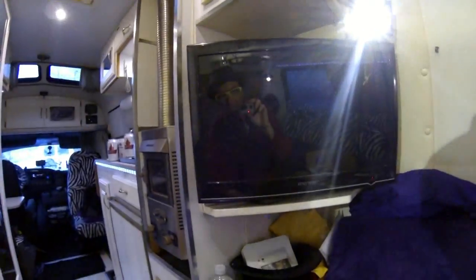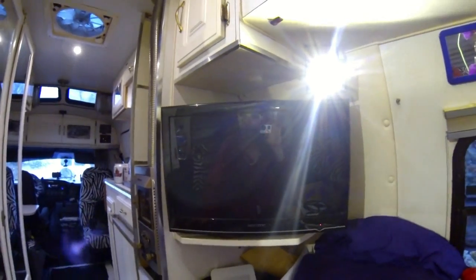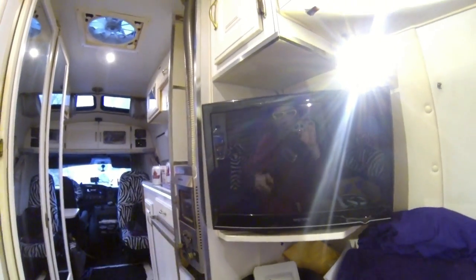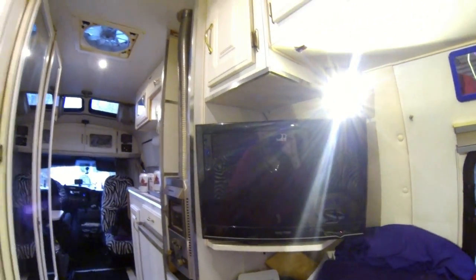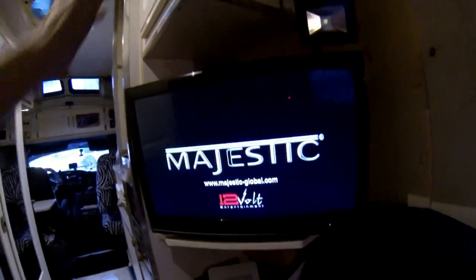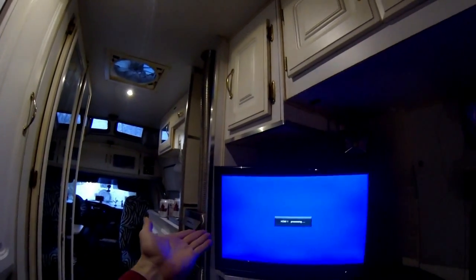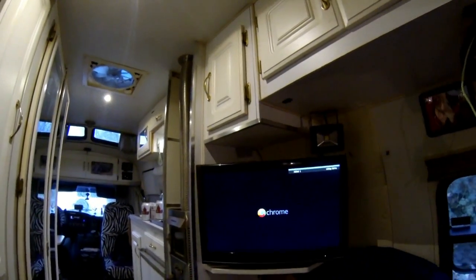The TV, I think I went over that before, uses approximately 10 watts. I think it went up to like 14 once, depending on your screen brightness and your settings. That's not using the DVD player, just the TV screen itself. It is LED as well. So basically the TV uses the same power as one of these lights above it. So again, make sure you get LED. Way more efficient than LCD or plasma, for example.